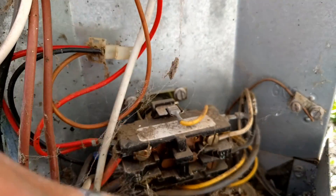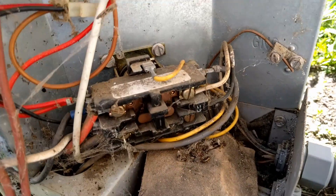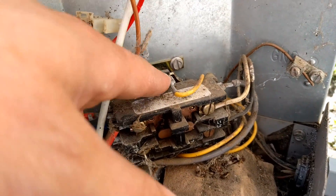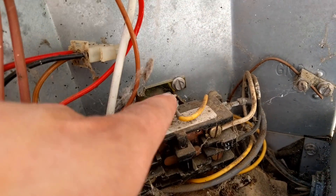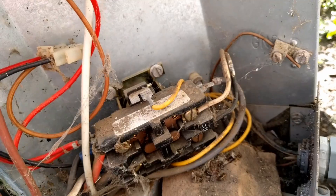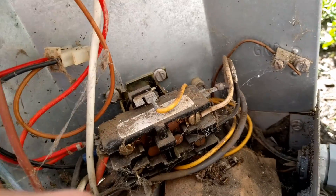The reason we do that is so that if you were to accidentally bump these control wires up against something, it's only 24 volts that feeds this coil, so it's not going to shock you per se, but if it touched the sidewalls, it could short out and blow the fuse inside of the furnace. So you just want to have all the power turned off for that reason.